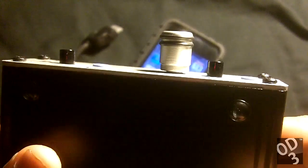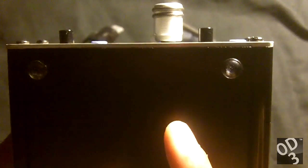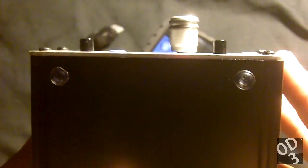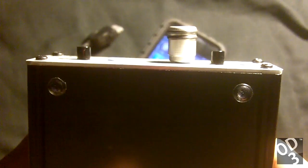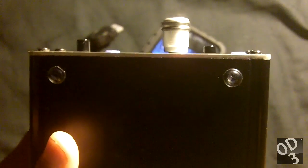When the switch is out it is at the lowest gain, which is what I have set right now at 2.5 decibels. When the switch is in it is at the highest gain, which is 6.5 decibels. This amplifier can also be set to as low as 1 decibel gain, which is the lowest I've heard of.